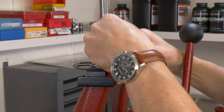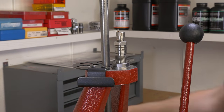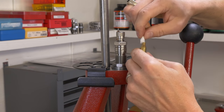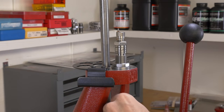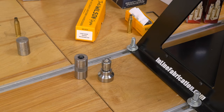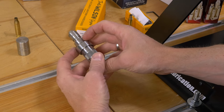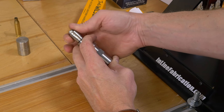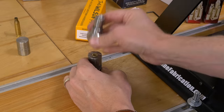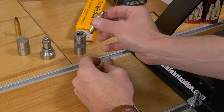This is why we start with just a hand tightening of the lock ring — so I'm going to back the die out a little bit. I'll apply some lube to the outside and also do a little bit inside the neck with a Q-tip. Recall we were at negative four; what we want is two thousandths of an inch of shoulder bump, so we should be at about negative six this time. And it looks like we're dead on. Now that we've backed the sizing die off just a little bit, we have our two thousandths of an inch shoulder bump — just what we want for this kind of bolt gun.